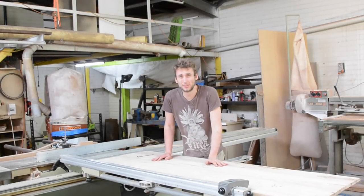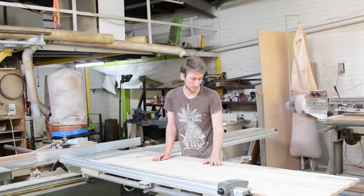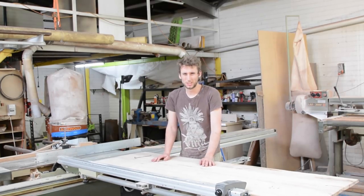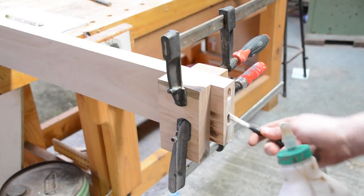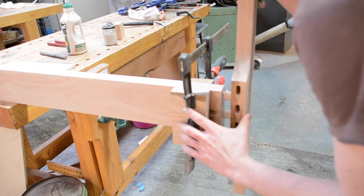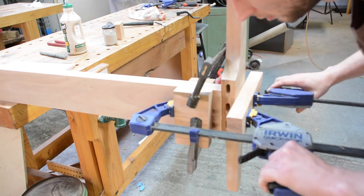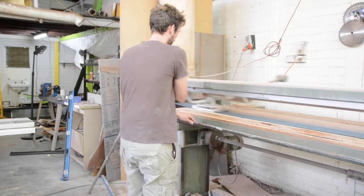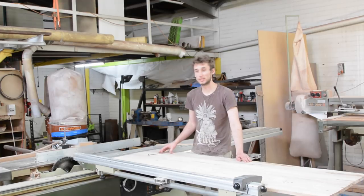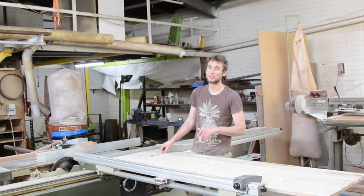While that panel was drying I had to think about how I was going to attach this thing. Originally I was going to do a long groove and slotted dado, but that's too much — so what I'm doing is pocket screws. I went ahead and glued up the part of the headboard assembly that needed gluing, and once that was out of the clamps I gave it a good sanding and got rid of all that glue squeeze-out. Now I'm at the panel saw and I'm going to cross-cut this panel down to its final width, then get on to making it conform to that curve.